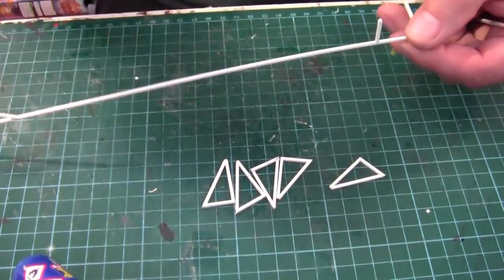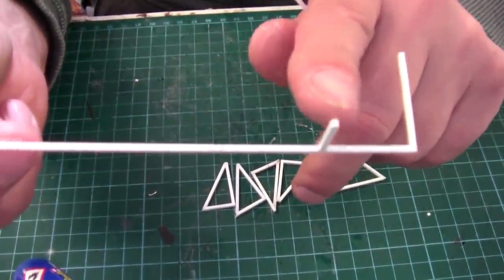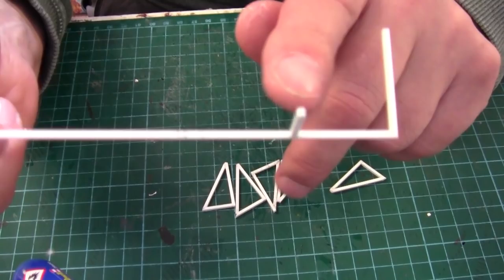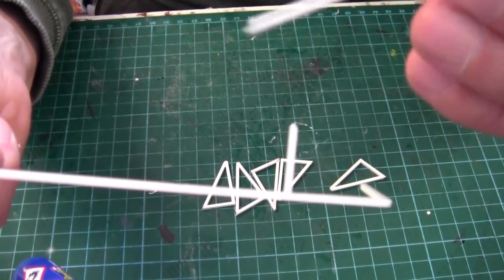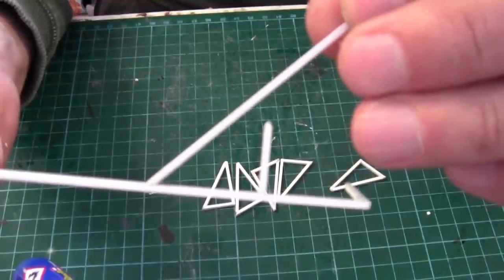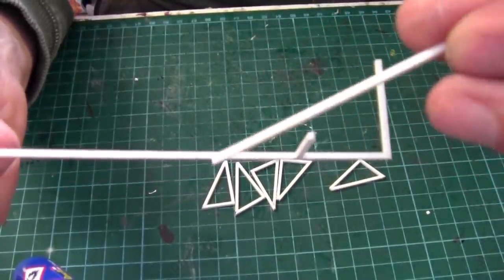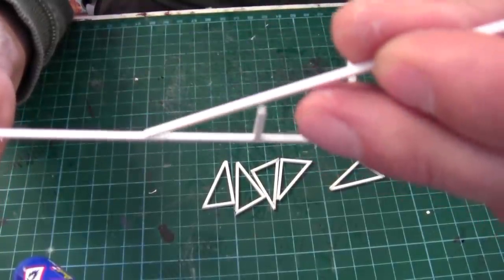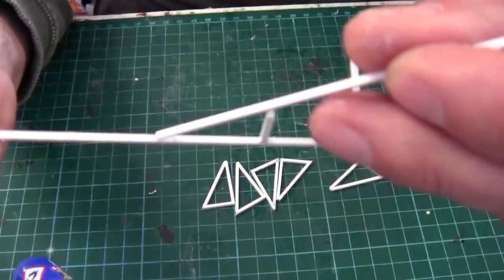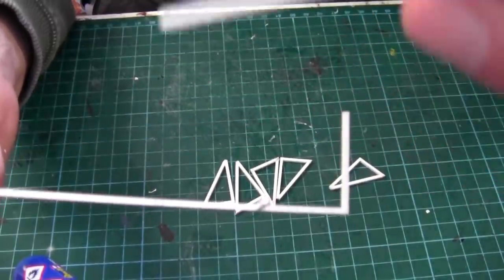As you can see, I've already cut this one down to that's 16mm now, that upright. And you can see there's a little chamfer both sides. So what I'm doing now is I'm lying this across there onto my mark, which I marked there, and finding the center line on the pivot on the top of there and just cutting it. And then once I've cut one, I'll cut the other one the same, because I'll use this one as a template.